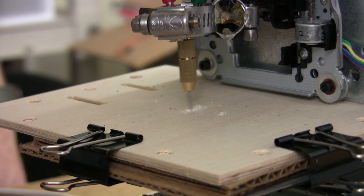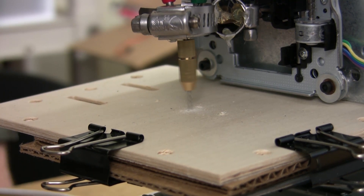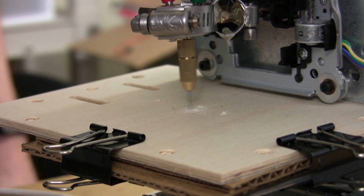Continuing to step it down, the wobbling eventually lessens. But because of the instability of the drill mount as well as the instability of each axis, drilling down too far or moving in the x and y directions causes the drill bit to tilt or the axis to bind.